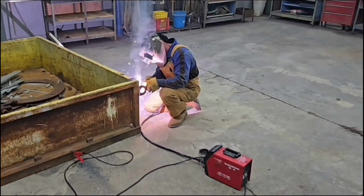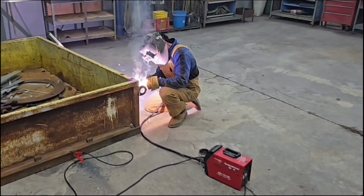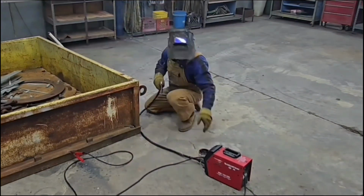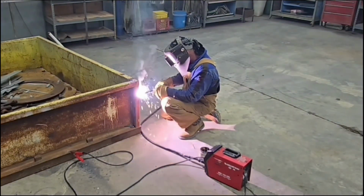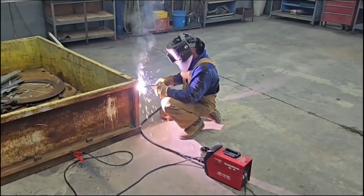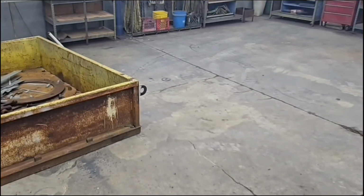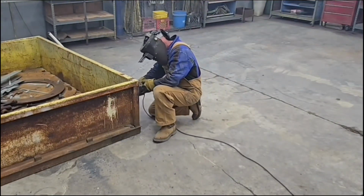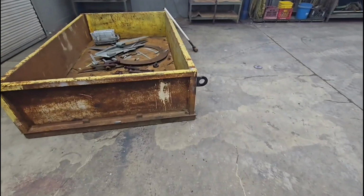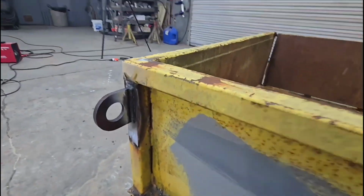And I've got a 1/2 inch pad eye here, and this idea of doing this little check came up recently because I was using the ARCCAPTAIN MIG145PRO on a job with this flux core wire welding some 1/2 inch plate, and I got a commenter saying that you couldn't weld anything thicker than 3/8 or heavier with a 110 machine because it wouldn't penetrate.